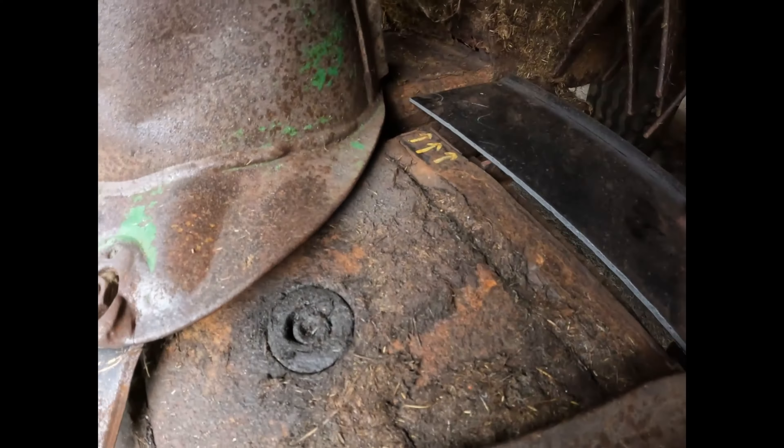We put the plate in this morning and it's a bit thicker stuff - maybe a millimetre or two thicker. So whenever you push it right up to the top there, it's catching on this toe, the big one coming along the bottom. It's catching just on it because it's out just a wee bit more than your hanger, so we'll have to nick a wee bit off the edge of the hanger too, to allow for the extra thickness. They're just cutting the wee chuck out to get around that, and then we'll see how much we need to slice off the hanger.